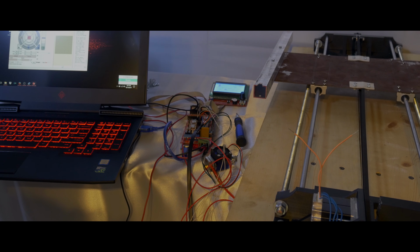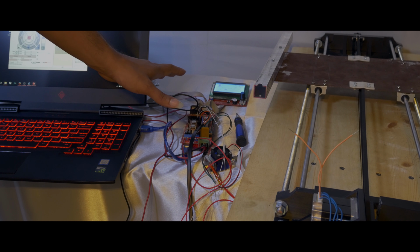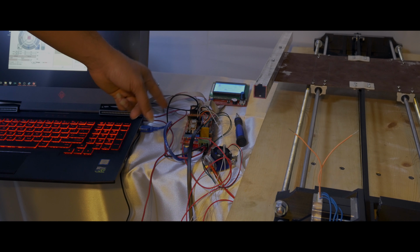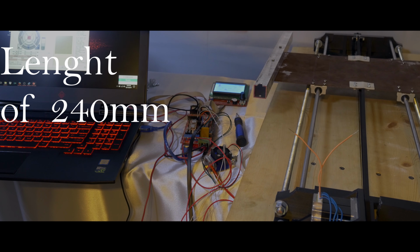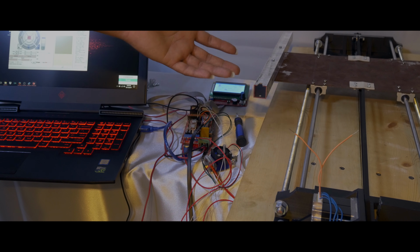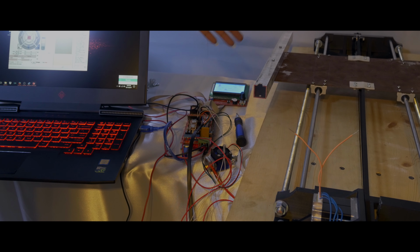That was 100. Oh, it's because, I'm sorry. Basically, this is ANET A8 programming, and the motherboard basically thinks that there's only 280 millimeters worth of travel length. So it's gonna stop after 280 millimeters. And with me doing a few 10s and then 100, and then it did another 100 and went all the way out to where it thought it could be at. It was too far out right now inside of its brain, thinking that it can't go no further than that.